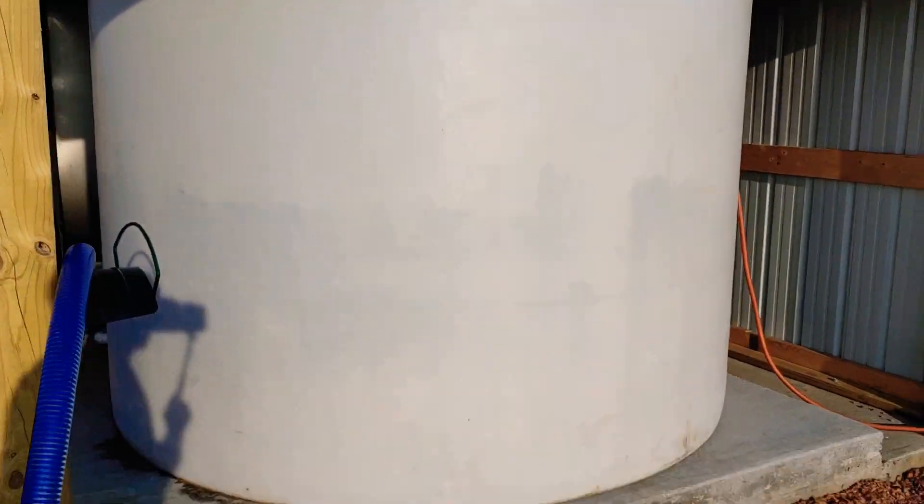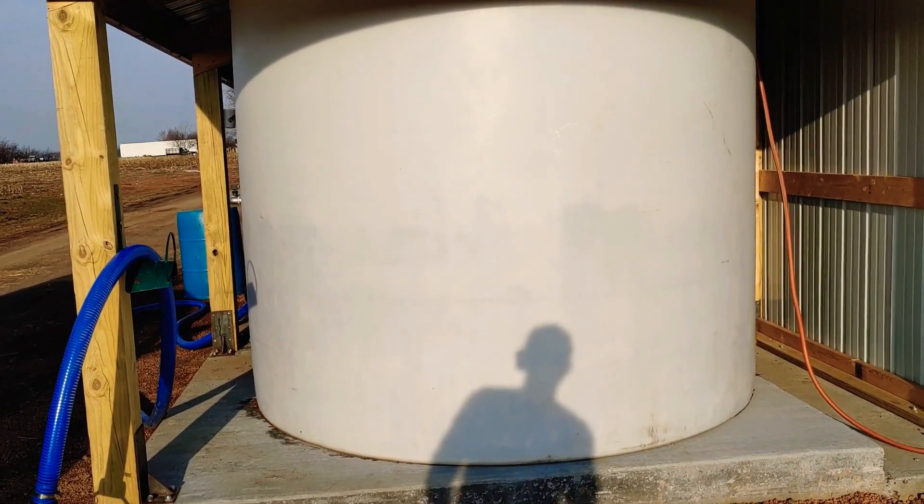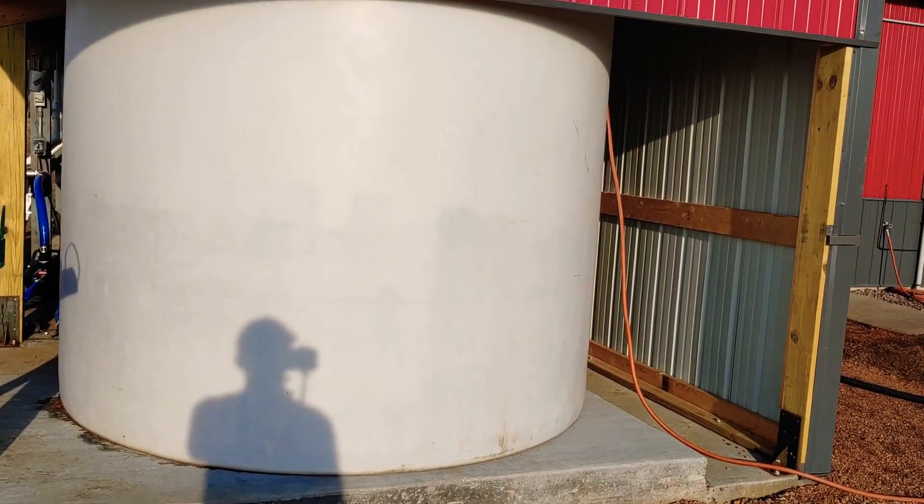Right here is a big plastic tank. Some people think it's for sap when they see it's full, but actually this tank is for our reverse osmosis. We capture the water that's taken out of the sap by the RO machine and use it to clean and rinse the RO membranes for rinse and wash cycles. I'll show you the machine when we get inside.